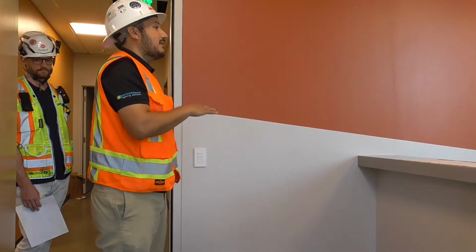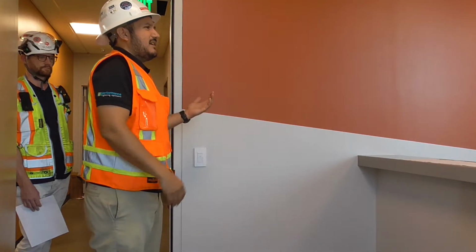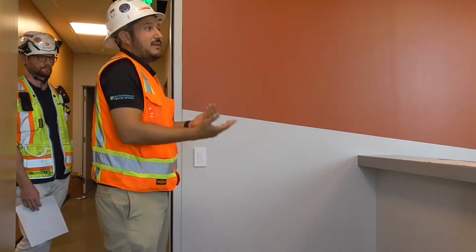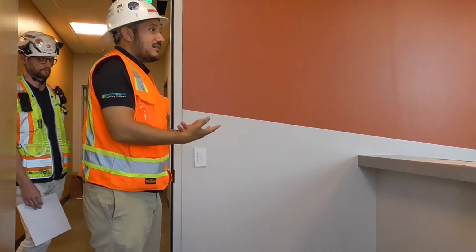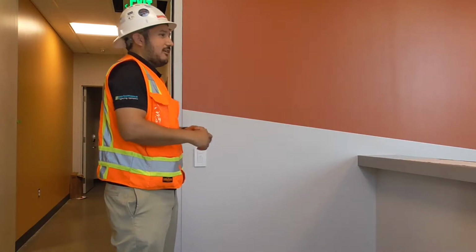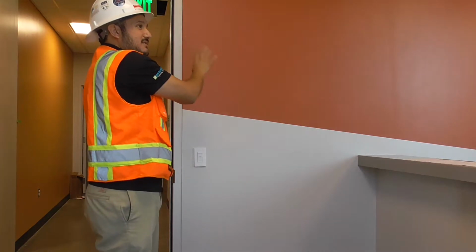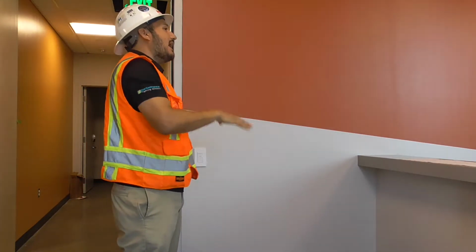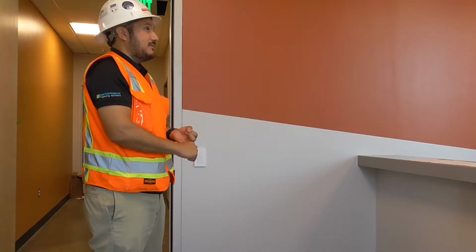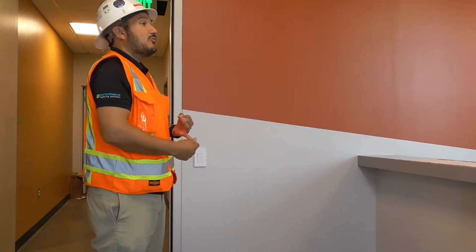The only thing that's not going to be working perfectly fine is your exterior lights, because depending on when that panel lost power, it won't be able to send the command to the exterior lights to tell them to turn on or off. When it gets re-energized though, it's going to say, hey, you guys should be off or on, depending on what time of day it is, and it'll start working. So losing power connectivity to that will not stop your day-to-day action, it will just stop any additional building management or time schedule capabilities.